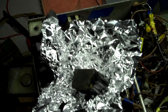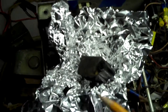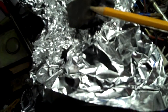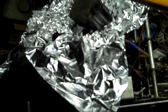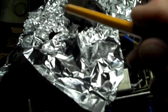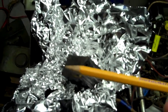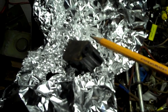What you see here is that bakelite block with aluminum foil wrapped around it — I moved it so the bottom is facing me. The aluminum foil is wrapped around it to protect all the components and associated wiring. I'm going to hit it with the heat gun, and once I get it all soft I'll just push it out from the top side, just like I did the other one — the procedure will be exactly the same.